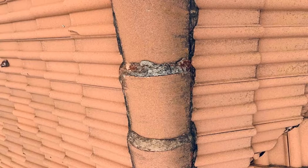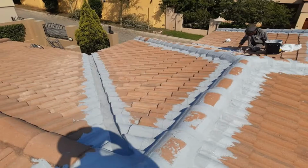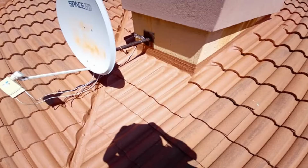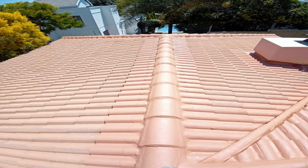First, the tile roof had to be cleaned of all debris and dust particles between tiles. All damaged and cracked tiles were removed and replaced with new tiles. The valleys were carefully cut open and flashing as well as plumbing vents cleaned. Then the craftsmen waterproofed all hips, valleys, ridges, flashing and plumbing vents properly. A fresh coat of high-quality UV-resistant paint finished the job.